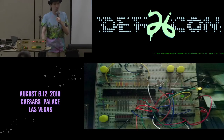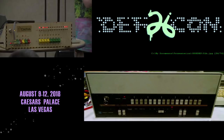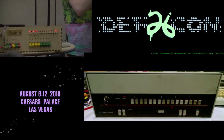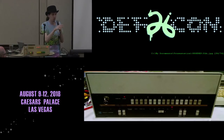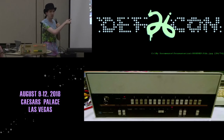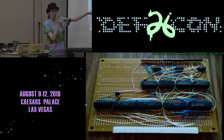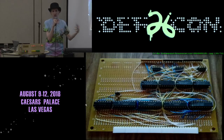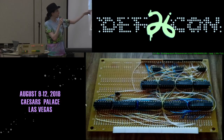When it comes to entering data, I liked the idea of push buttons — the idea that I can press a switch and set and clear a bit. I started working on my circuitry, then went out to Vintage Computer Festival Midwest where somebody had that HP 1000. I'd never really interacted with one. Mike Lowe was demonstrating it, sat me down, and I started pressing the buttons — and I realized: this is the idea I had. Somebody did it. That means I can do it. So: the top row is a bunch of flip-flops to store each bit, two bits per chip, and the rest is interlocking buffers to make sure data flows in and out when it should.